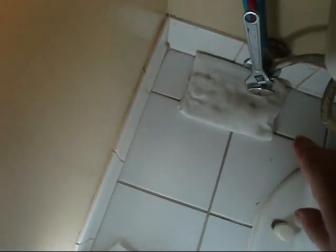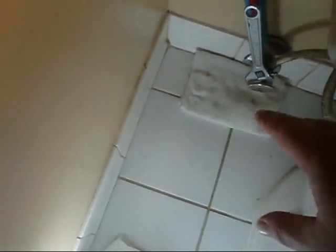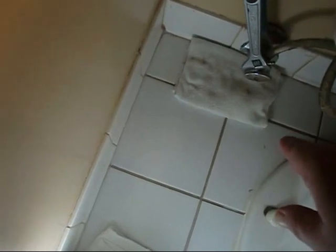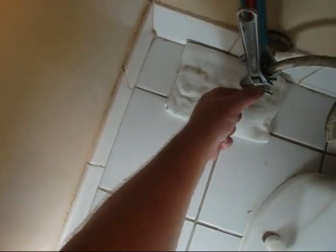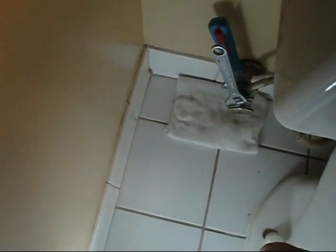In this day and age, nobody should be using gate valves anymore. This is probably my last one. I've got ball valves on everything else in the house. This has got to go. So I'll go to Home Depot and get a quarter-turn valve. Even though I did get it tight and stopped the dripping, the gate valve — I had to put my channel locks on it and wrench it hard to stop the leak from the tube. But I think we've got that fixed for now — no leaky leaky — so let's get back to the job at hand.